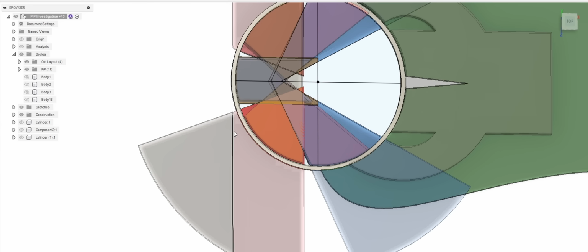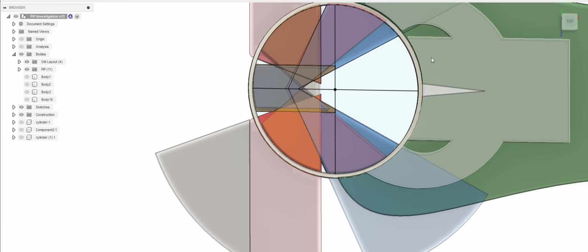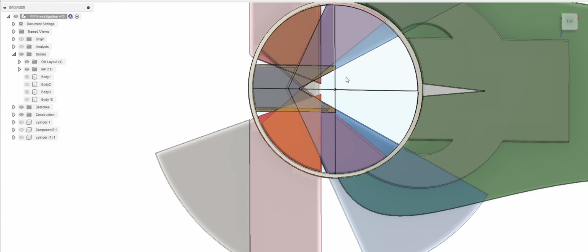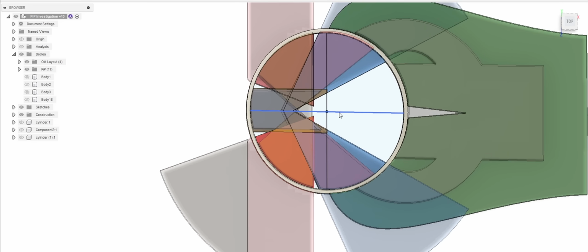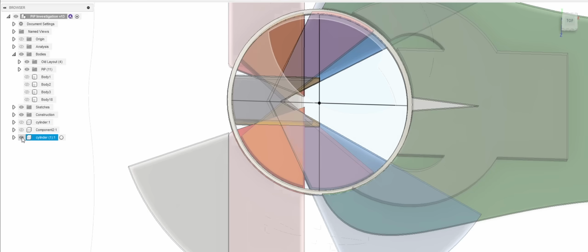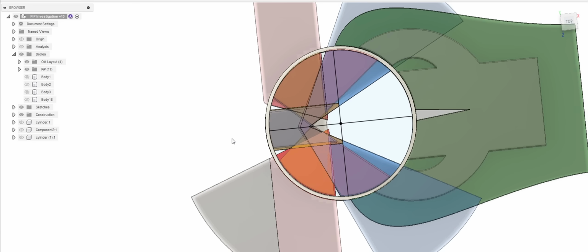But I didn't want this angle to be pointed this much towards the exhaust port. I was supposed to take this angle of the old B ports and make it less steep, so have it pointed more across the cylinder than towards the exhaust. And this is where I screwed up. And I think I can actually see, because I was learning CAD at the same time. This was my first project in CAD, this cylinder. And I can actually kind of see where I screwed up.